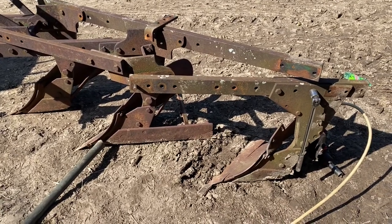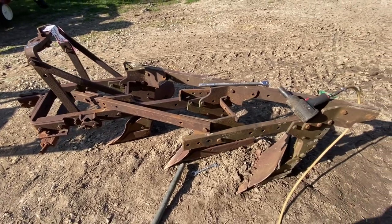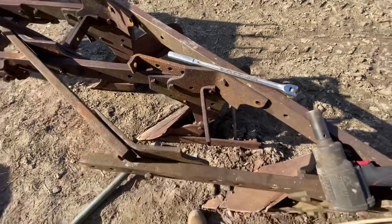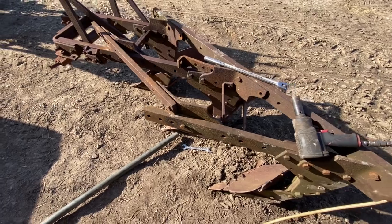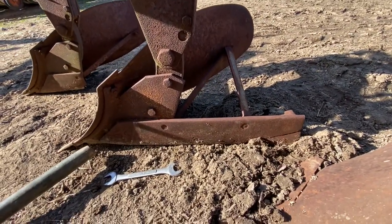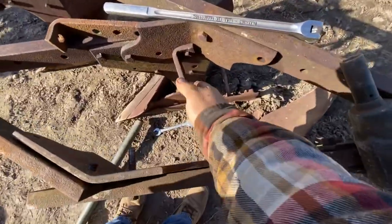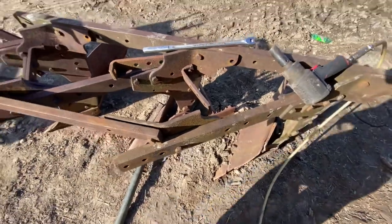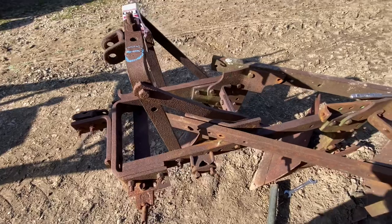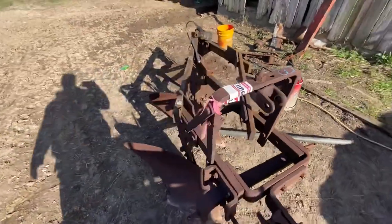Here's what I've got, and this will be how it is. I need to drill two holes in this beam here to put this plate on — that's where it's supposed to be according to pictures I've looked at of others. I also need to move this long land side back to the third bottom so it won't interfere with the bottom behind it. I've got to put this brace in here, and I'll need to make a piece of metal to go from here up to this bolt here.